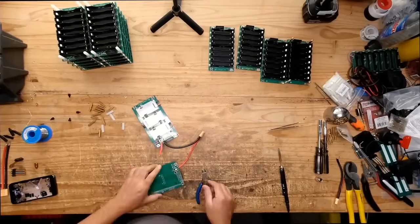There's less likelihood of any of the fuses blowing, because with a differential of voltage, that's when all the problems start happening. Why not 14S, 48? It is 14S. It's going to be two of these boards that are 7S in series, so then it becomes 14S, 48 volts.